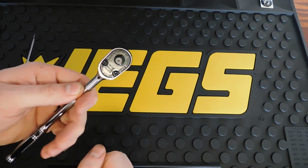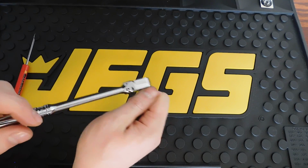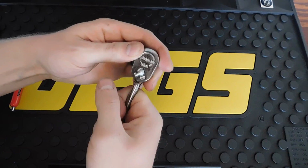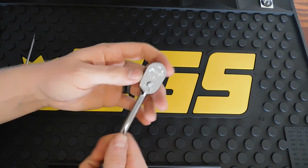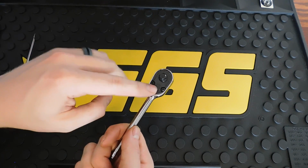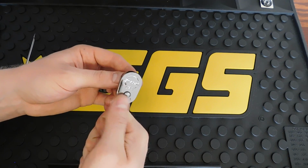We've inspected it now, so if anybody has seen anything that was out of the ordinary with this ratchet, please let me know. Now, it's not binding or anything like that. It's not jamming up. The reverse lever operates really well. So if you do this job and your reverse lever doesn't line up with the on-off marks, you've assembled the ball bearing and spacer plate incorrectly, so just go back in there and assemble it correctly and make sure that the reverse mechanism operates correctly.